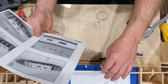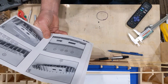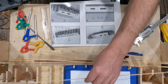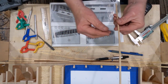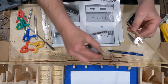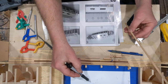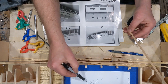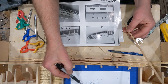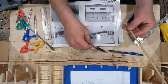All right, so what I'm going to do now is cut all these to size. We'll have to put our teak oil on them, glue them. And I'm wondering if I should taper the edges. A lot of times when I plank, I'll take the edges and cut them back to like a 45. Not quite. And then the next one that goes on top of it will alternate. So it will flip, and I'll turn it upside down so that when these two match, as you sand, there won't be as noticeable a line going through it.